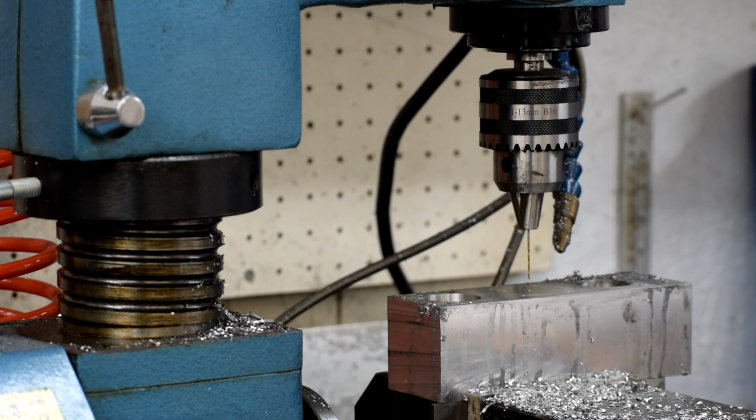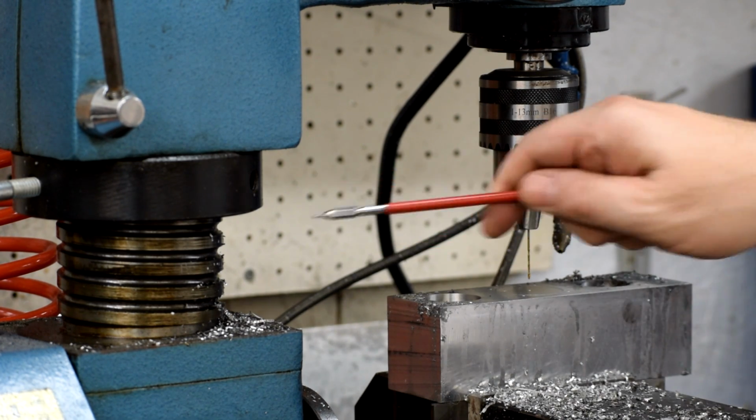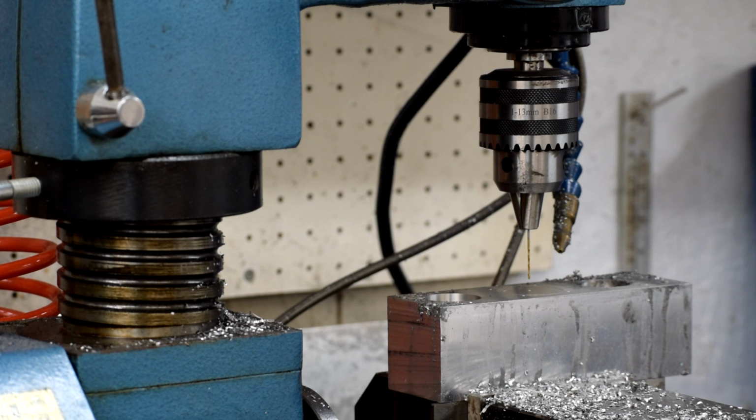It is what it is. There is some slop in the bearing that helps me out there. It doesn't have to be dead on perfect. But if I had a proper machine that had a square column, all I'd have to do is move the column or move the knee, and it wouldn't be a problem. So something to keep in mind if you're looking at buying yourself a hobby machine is to look at these sorts of things and figure out the so-whats that come with the design of the machine. Anyway, let's get the head moving and get this thing reset.